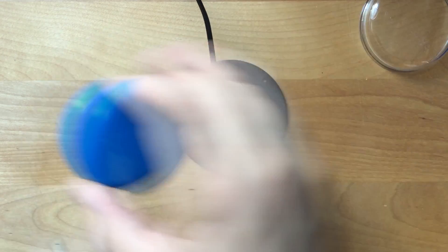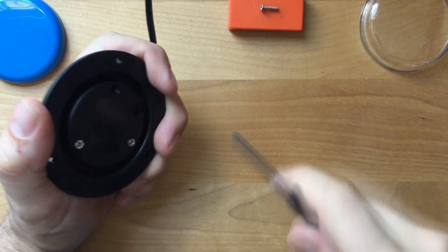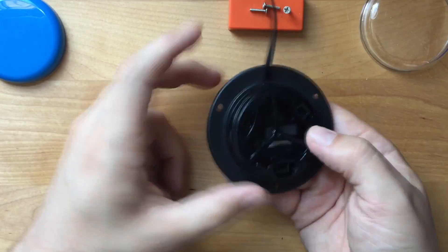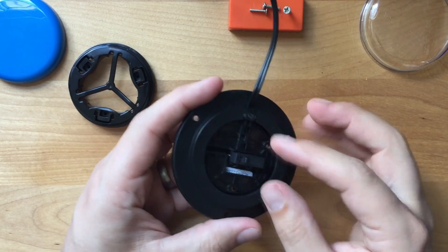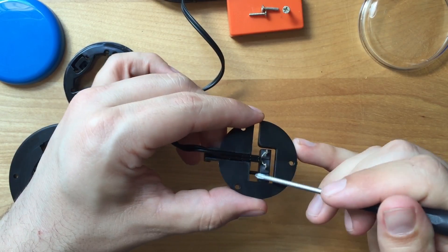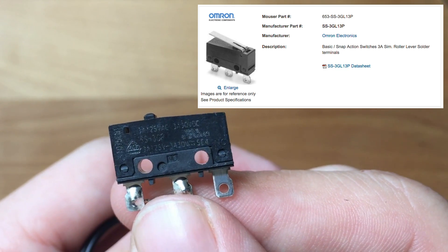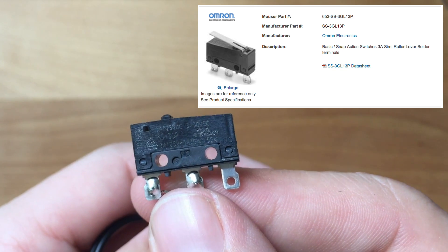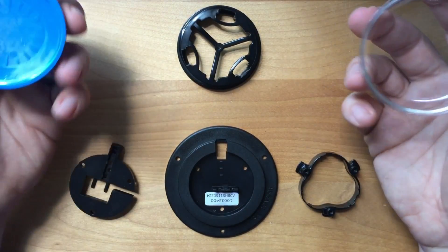But enough of what's on the outside, let's see what's on the inside. First off, we'll remove that clear cap and unscrew the colored cap beneath it. At this point, you can see the switch at the heart of the case. There are three screws holding the main case together. This button is just held in by a couple plastic pegs. This section of the base is support for one side of those pegs. If we detach this cable, we can see the pegs and how the button slides off. Slide the button off, the cable out, and that's it. At the heart of this switch is an Omron G3P series switch with some nice big solder points. This switch goes for between a dollar and a dollar fifty depending on how many you buy. But the real cost in this switch is the body. Custom injection-molded parts are expensive. It's not about how much each part costs, but rather the cost to make the mold that makes each part. It's a great switch — even though the button and the cable, the parts that do the work, couldn't have cost the company more than three dollars.